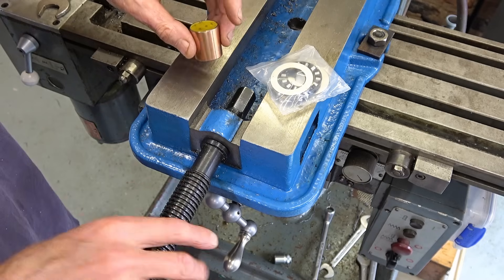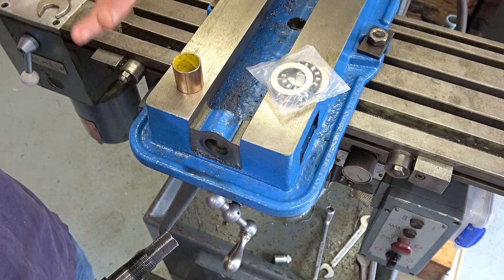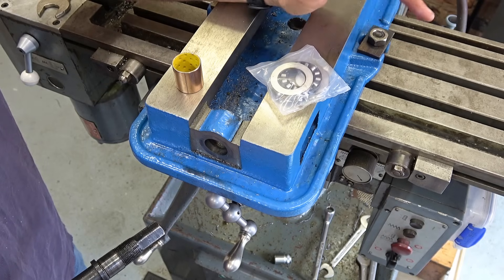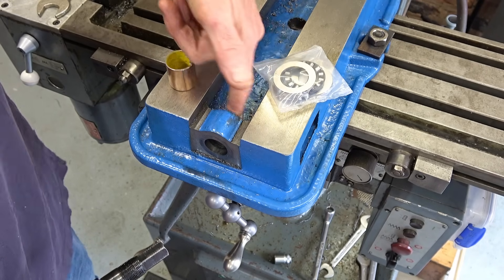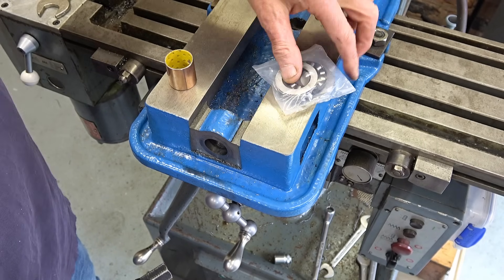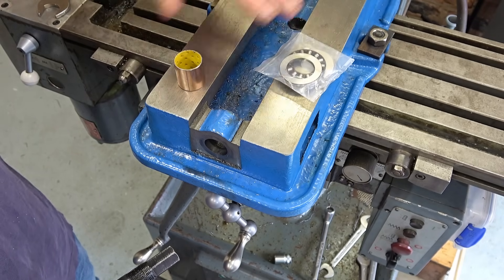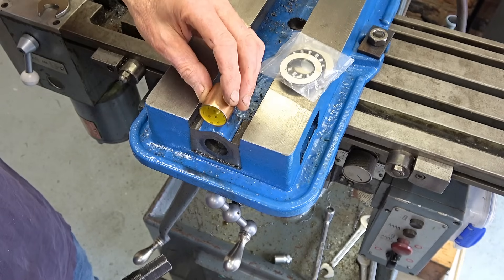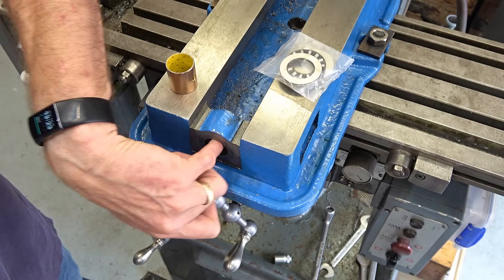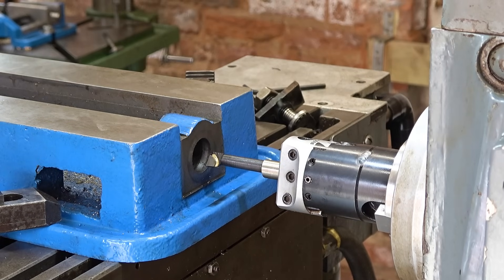Job one: I need to bore this out to 27mm. That's a challenge, because I don't have a 27mm reamer or drill — or an inch and a sixteenth, which is about the same. This back face has got curves on each end, so I need to make it flat right across so that the bearing will sit on there properly. That will be fitted when I make the new screw. To begin with, I'm going to fit that bush, so I need to find a clever setup where I can get in here and bore this out to 27mm. I think I've got a setup that will work.